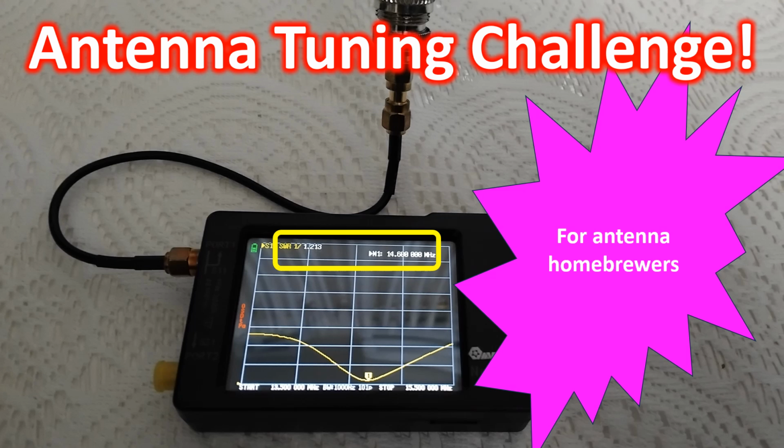How to proceed? A simple way is to find the wavelength for 14.680 MHz, which comes to 20.42 meter. Next, I calculated the wavelength for 14.075 MHz, which comes to 21.30 meter. For simplicity of calculation, I did not take into account the velocity factor of the material of the antenna wire.